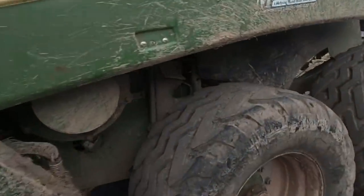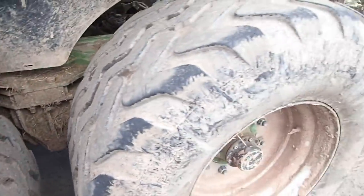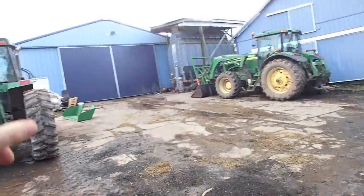We've pinpointed that it is the drums. We got the baler cleaned off of all loose debris. They weren't really hot, so I think what happened is dust and dirt got in behind there and it's burning out as ash, which can be a problem. The boys are working on the Jeep in the shop, so I'm going to put this thing away and attack it later — not today, maybe tomorrow. I'll just pop it all off. Those drums should come off fairly easily, though I may end up pulling the spindles completely off.